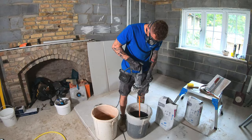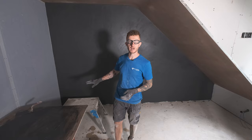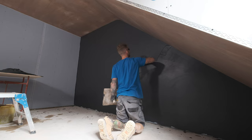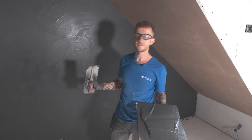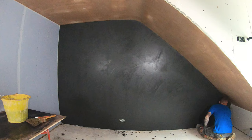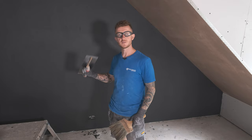I've mixed up my second coat of plaster and I'm going to apply it to the wall now at a thickness of one to two millimetres. That's it, my second coat is on. I'm now going to leave that to firm up enough, ready for my next flatten. The wall has been left sufficient time to receive the final trowel, so let's get it finished.